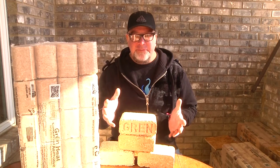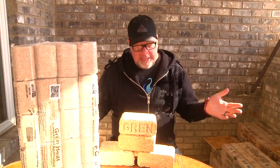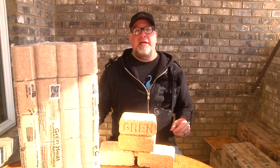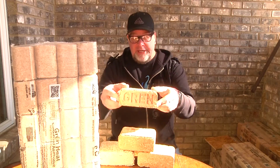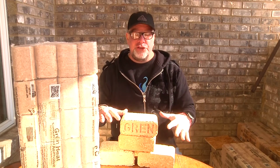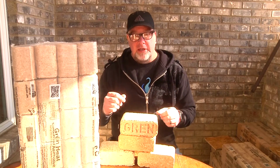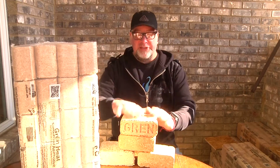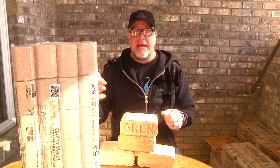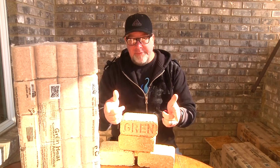So I wanted to do this experiment for myself to find out, is this really worth the money? How does it stack up against cordwood? No pun intended. And so what I did was I put together this simple test. I was gonna go with the Green Heat, same weight as my cordwood. I was gonna get my wood stove at the same amount of ash, same amount of oxygen, and try to keep the temperature at the same intervals as when we started it, and then I monitored what was happening through the burn and how long. So this is what we did, and check it out, and then I'll give you my opinion.